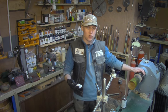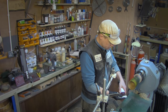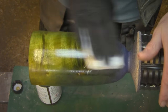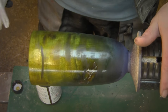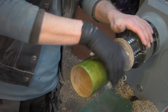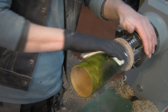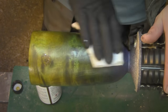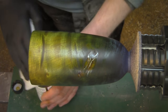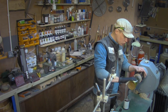Now it's dry, the piece looks a little bit flat and dull, so I'm going to apply a little bit of my preferred Danish oil, and that will liven those colors up considerably. As you can hopefully see on the video, they are really coming up nice and vibrantly. A couple more coats of that, let it sink in, and then it's important that I let it dry.